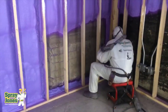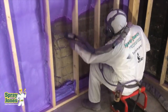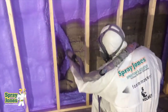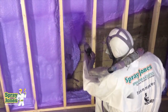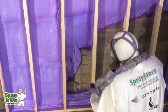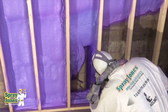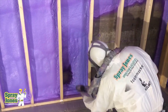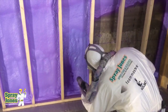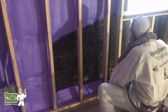So why take the chance? In a 3.5-inch wall you'd be paying for 3.5-inches plus of insulation; in a 2x6, 5.5-inches. When spray foam — particularly closed-cell polyurethane foam — is polymerized and made from raw components into the final product, there's something called exothermic heat that's created. If you build enough of it fast enough, it can crack the foam, and the core temperature can become so hot that once it gets oxygen, it can spontaneously combust. So you have to use special chemistry when doing large pours or large sprays of foam — special foam that doesn't build up high exothermic heat — and there isn't anything on the market that's going to do that for you.